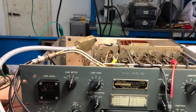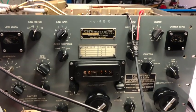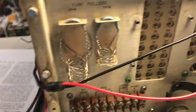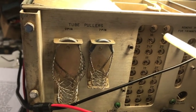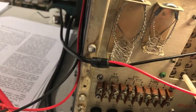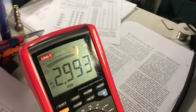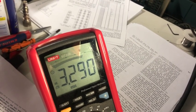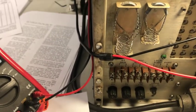I will put back in the receiver and make the full RF alignment again, because I believe there is something that needs to be treated a bit. Then I believe the receiver should be ready to go. I'm now in the back of the radio performing the crystal oscillator adjustment since it's quite out — I didn't adjust this unit yet. Almost no reading, and as I turn it, I increase. Pretty much all those trimmers are out of alignment.